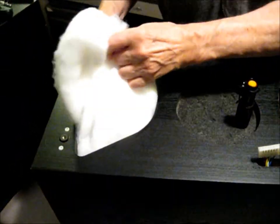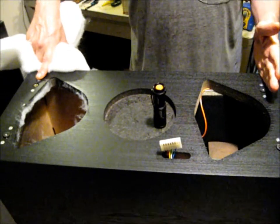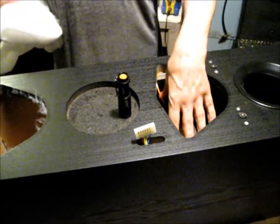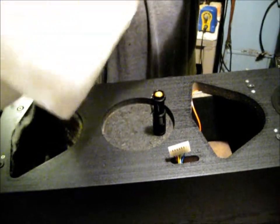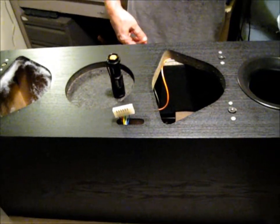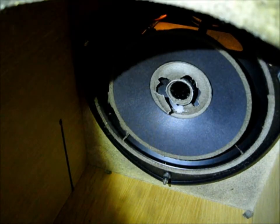Next, we're going to get the woofers out so we can rebuild them. We've got two woofers out — you take the mid-high pack off, and it gives us two cutouts here: accesses to install and remove the woofer. We're pulling the damping material out — put it aside so you'll know where it goes, put it back in like you got it out. There's a certain amount that goes in the bottom and a certain amount in the top. The top woofer is aimed up — it's an upward firing woofer. This foam goes around the cabinet and right up against the woofer, but you can't get the woofer bolts out with this in the way, so you have to pull it out too.